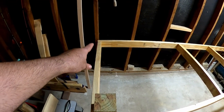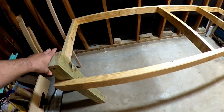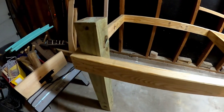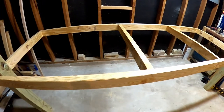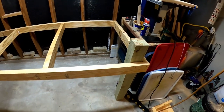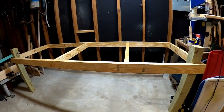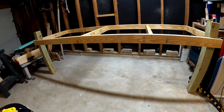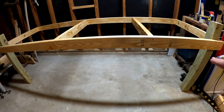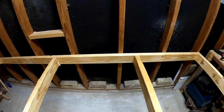If I think it needs something else right here, then I'll just put a 2x4 leg that goes straight down to the floor. But I think it's gonna be pretty solid. And again, I'm about to cut that flush, so we can put the 3-foot plywood on there. He only wanted it 30 inches tall. So I don't think we're gonna have room to put that 1-foot shelf on the bottom, honestly. We will see after we get it all built and everything.